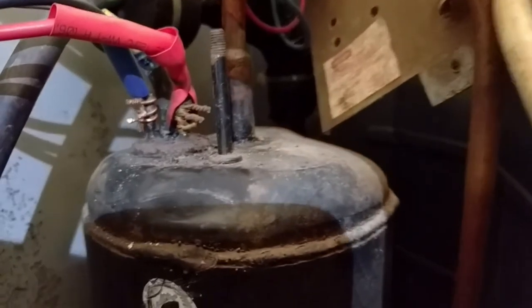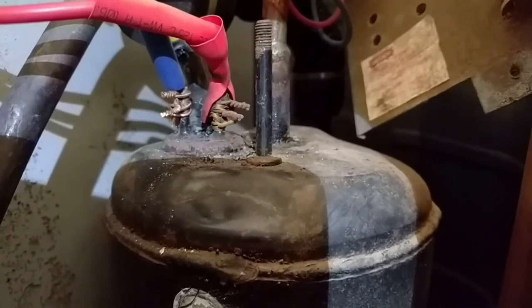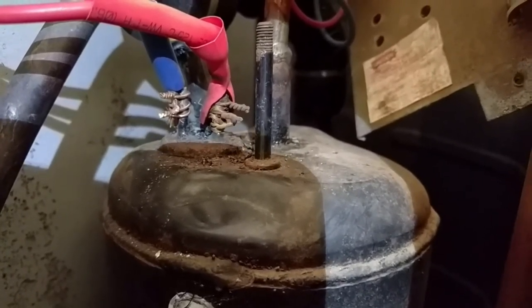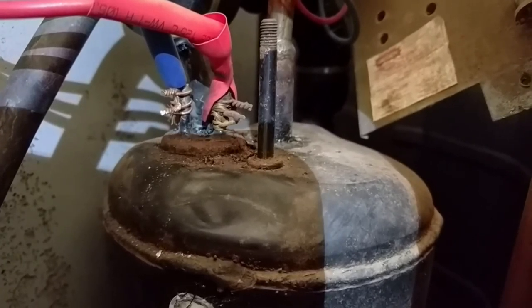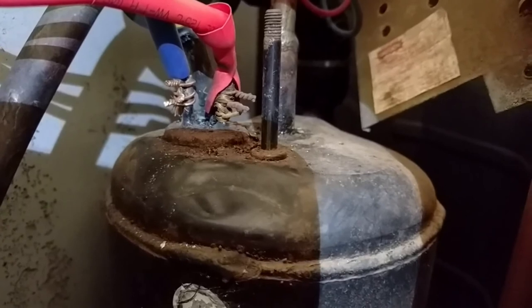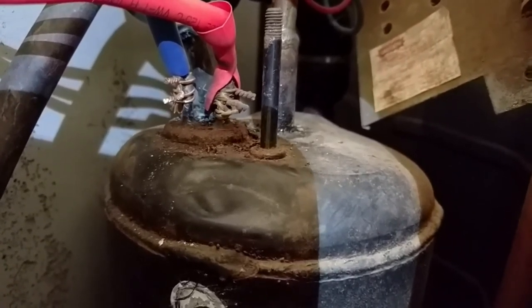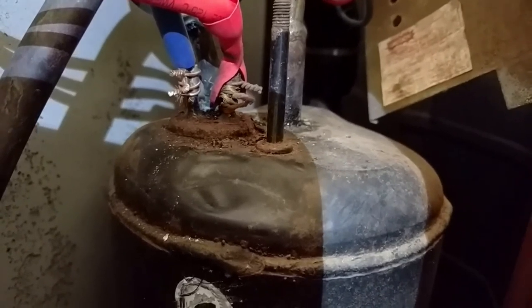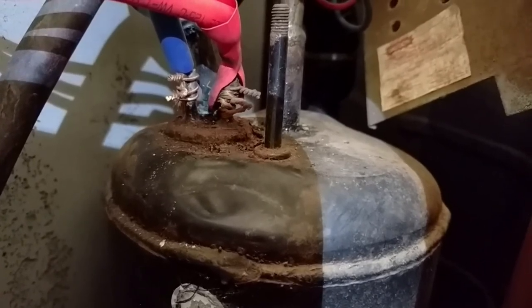That's the final fix. I still have to put plastic in between the terminals and the pins so that they are somewhat protected. But that's the essential fix: the wire comes in vertically, abutting the pin, and then three sort of handmade clamps just make sure the wire is making proper contact with the pin.